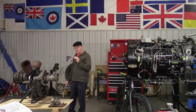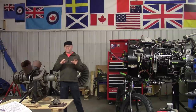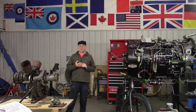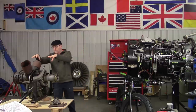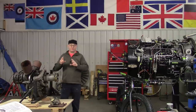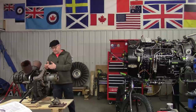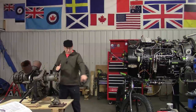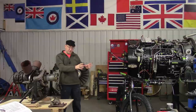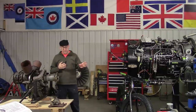We're going to do a little more orientation on the Allison 250 C18, which is so old it's not even in the general internet search results — you'll get the C20 and on up. The C18 was the first one, rated 317 horsepower versus 420. The power-generating section — the combustion, the turbines, the compressors, and the power turbine — are fully capable of producing 420, but it's been derated because of limits. This feeds torque to the main helicopter gearbox, and various sources say the early Bell Jet Ranger's main gearbox was limited to 300-something horsepower, so this was derated to 320.